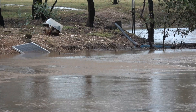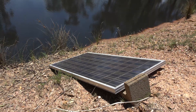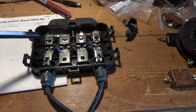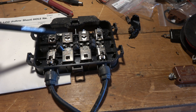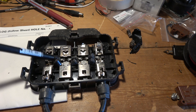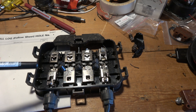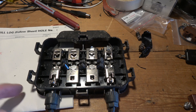It seems to work okay after being underwater for a while. Now typically the connection boxes look something like this — that's all negative down there, and you've got negative, plus 12, plus 24, plus 36. The reason they bring these out in the connection box is they put diodes across, so that if part of the solar panel gets in shade, it doesn't totally wreck it — that part just gets bypassed. So you can't actually get three separate 12 volts the way it's wired.